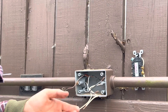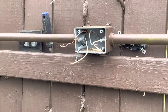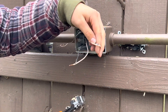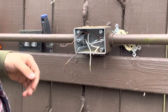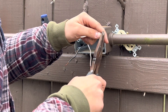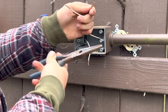For reference, the white wire is the neutral, the black is the common, and the bare is the ground. I forgot to mention earlier — you may also need wire strippers, because how they had it wire-nutted, to put it on the terminal screws you need an inch of stripped wire. Once you have your wires stripped, use your needle nose pliers to loop the wires at the end — just loop them like that and do that to all your wires.